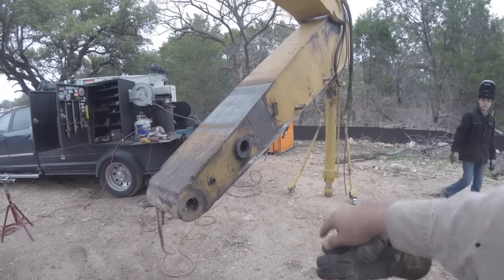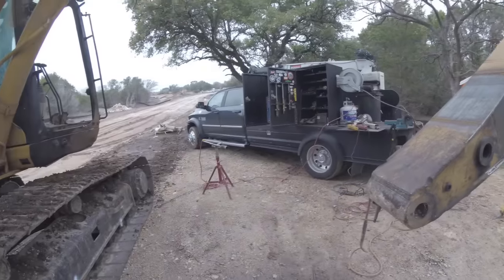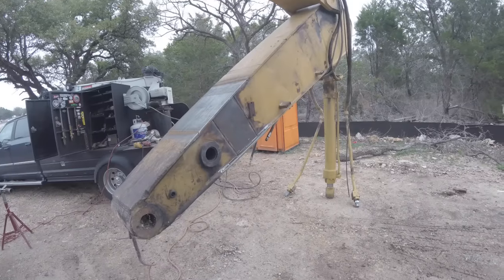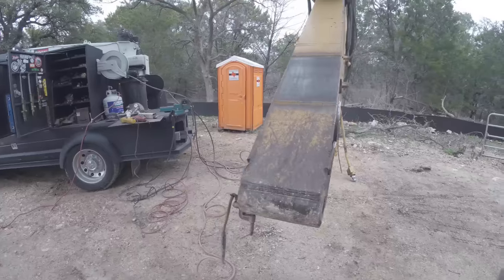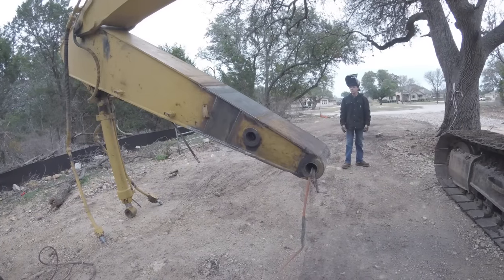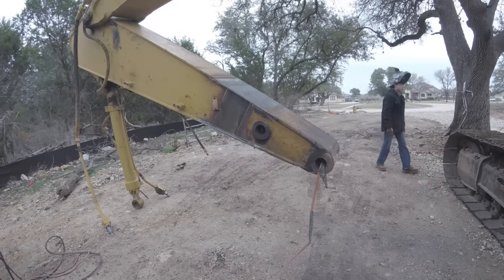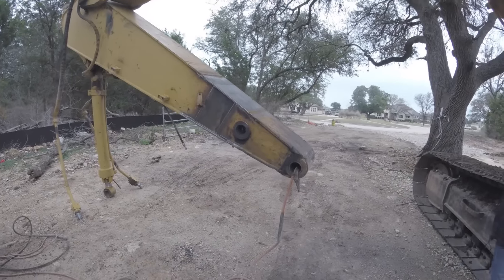I didn't finish welding the patch plate, so I gotta preheat it. Got my little stand set up there because it's I think 41. Steel's a little too cold, so we'll be warming it up for a little bit and then filling it in. So almost there. It should be done hopefully this afternoon. Then I don't lack much, right? So just warm it up plenty so it doesn't crack, doesn't have any issues. And so hopefully that'll work. All right, see you guys.